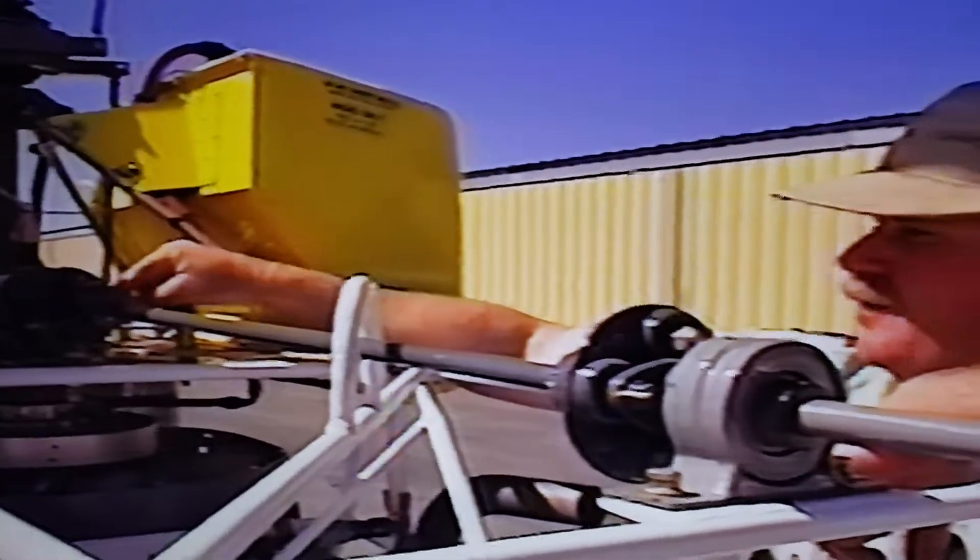Skipping to the tail rotor — this drive shaft couples to the back of this transmission using Morflex couplings. They're a fail-safe coupling because they're rubber-impregnated and use four bolts. If the rubber ever fails, you still have the steel housing which captures what's left of it to keep driving the tail rotor. These are an off-the-shelf item — you can buy them anywhere and they just last forever.